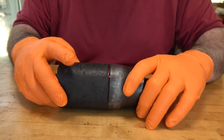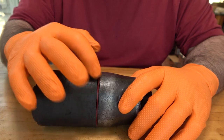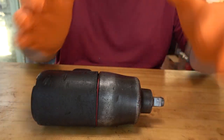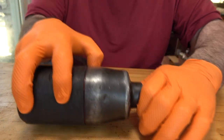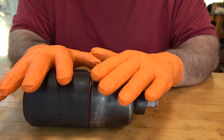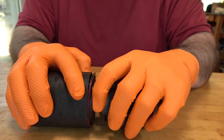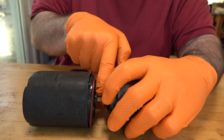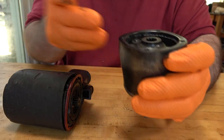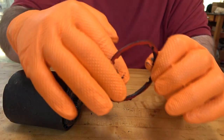Once you remove the four screws, the hammer housing and the rotor housing are going to separate. Note that gasket that's in there. When you pull this apart, keep the unit on a horizontal surface like your workbench, because if you tip it and hold it on end and you pull this apart, the rotor assembly or the hammer assembly is going to fall out. So keep it horizontal and gently pull the two different sections apart. The hammer housing here just pulls off of its mating surface with the rotor housing.